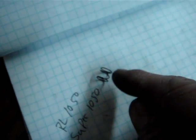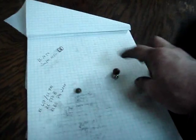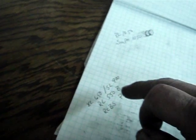All right, see that? Can you do that? I don't guarantee that you can. But the big thing here, you can take a Dillon spring and take a half a turn, like a half a gap off of it, and still run the steel ball, and it's going to solve a lot of your troubles. I'm trying to get perfect, and I'm really close. There's a ball for the 1050 Dillons, there's a ball for the 650 Dillons, the SL900 Dillons, the RL550B Dillons, and the RCBS Pro 2000s. The half-inch ball fits both of the 1050s, and it lives right underneath the shell plate.